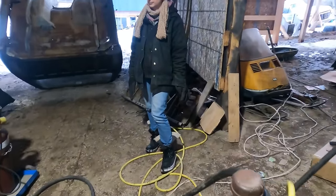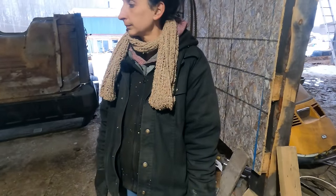But now you see how fast it's gonna take if we wanna sandblast the whole body. It's not gonna take long, will it? It'll go pretty quick, but we're not going to. We don't need to sandblast at all. Just where I weld. And where it's really rusty, we'll sandblast it. And we'll put some good metal in it. And if it's rusty and don't need metal, then we'll just fix it up with some high build scratch filler primer. Yeah, and then seal her up and then put your paint on it.